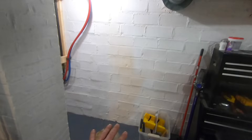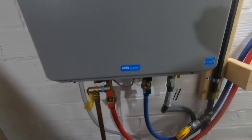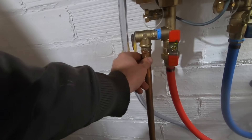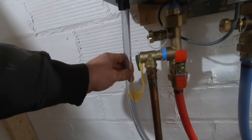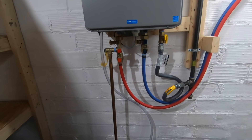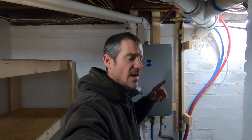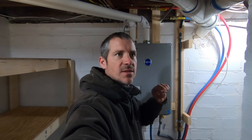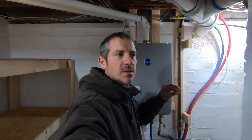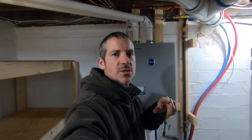We've got the old water heater out — you can see how that opens up the space down here. We've got the new one all done. We took the relief pipe off the old water heater, cut it to length, and put it on the new one. We've got our condensate line ran over to the drain. Checked for leaks — we're good. So hopefully you guys enjoyed this install video on the tankless on-demand water heater in an existing house. I have one more to do in the house I'm building — that's a new construction — so it'll be pretty much the same but with a few differences. I'll bring you that video when I do that. Thanks for watching, and we'll catch you on the next video.